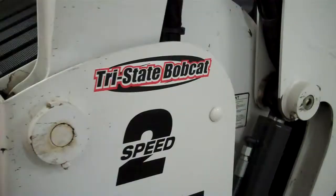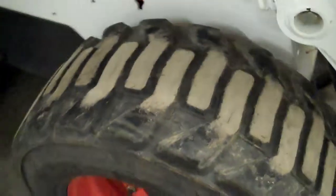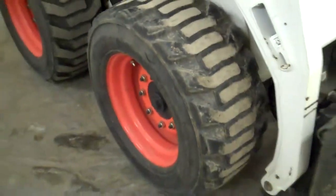It's had careful use and they went right back into a 205. So it's a nice size machine. It's got the big 12-16-5 rubber on it — Bobcat heavy duties. We've got Power Bobtach, standard flow hydraulics that's going to put out 16.9 gallons per minute.